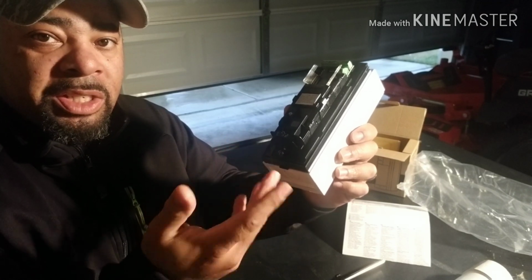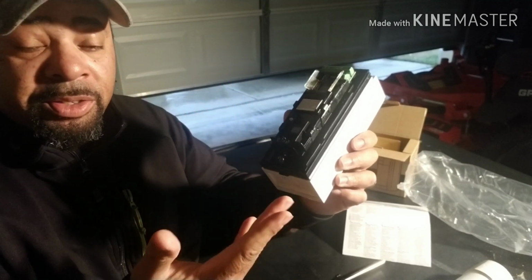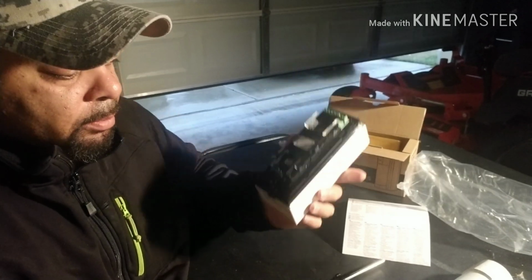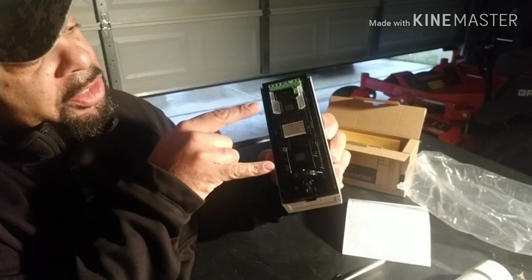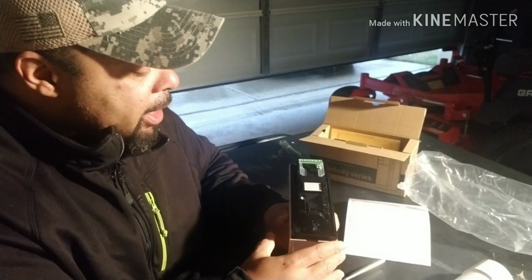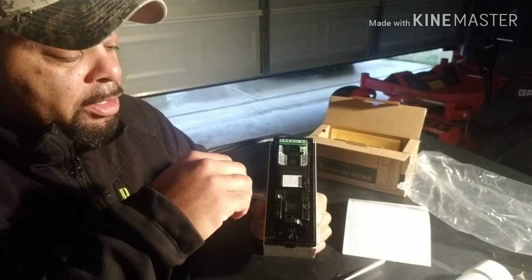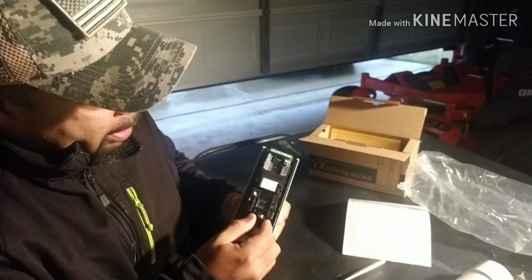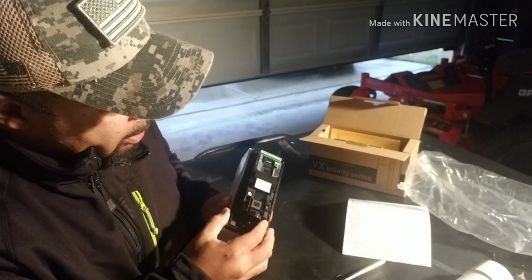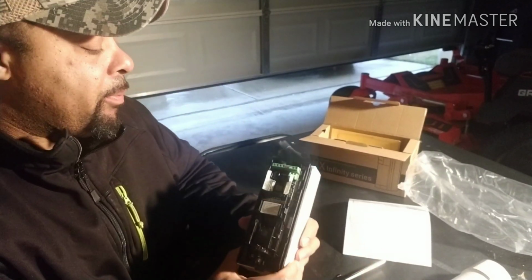If they open up the lens for some reason, the tamper switch triggers an alarm trigger. We'll get the tamper for whatever this sensor is going to be. And then I know, hey, something isn't right. But as you can see here, you got your two sensor lenses that you never want to touch. Okay. Right here, you have your microwave sensor adjustment knob, the little white knob there. You turn that, and that adjusts the microwave sensitivity out and in. All right. Then you've got your PIR sensor adjustment here, the knob out and in, and then how far out you want to go. And then you adjust your zones.